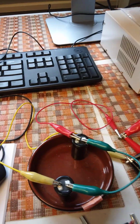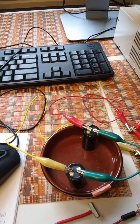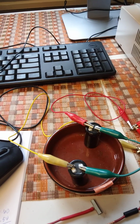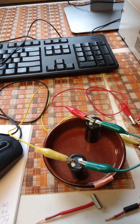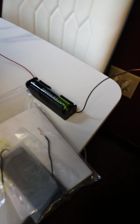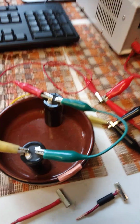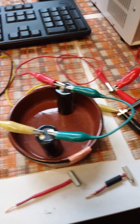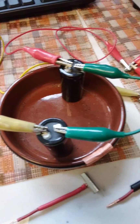Why the supercaps? Well, if I use lithium 3.7 lithium ion secondary cell, we generally, under our working conditions, get about 500 or 600 cycles of charge discharge, and then deterioration occurs. I don't want any battery deterioration occurring while I'm studying graphite materials that are in series in the circuit. So the rationale is to use a couple of supercaps rated at 2.8.